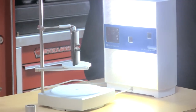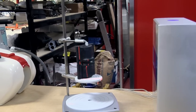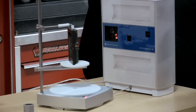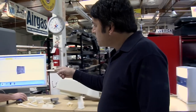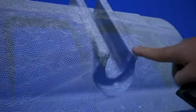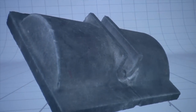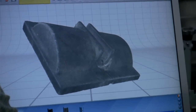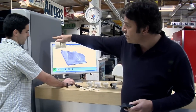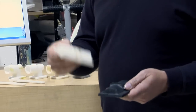These white lights are actually taking a photograph of the color of the object — see those red stripes on there, and see how they're swinging across? What they're doing is measuring the size and shape of the surface, doing about 50,000 points per second. Inside the computer we have a model that looks like what you see on the screen now, and we can swing it around. We've made a computer model — if you zoom in you can see it's made of tens of thousands of tiny little triangles. We can then take that information and transfer it to other machines like this printer over here made by Dimension, and this is a copy of the part made in ABS plastic.